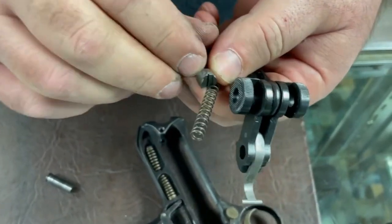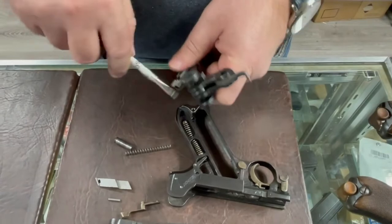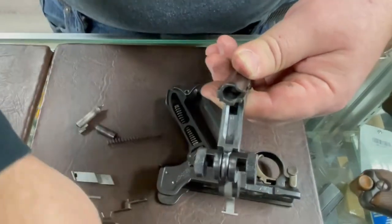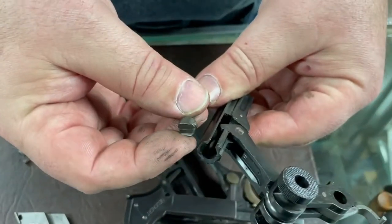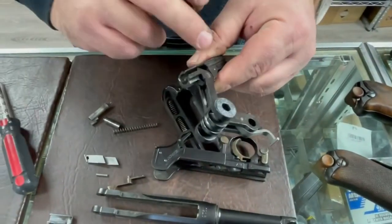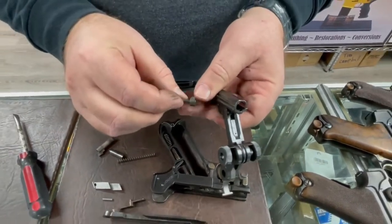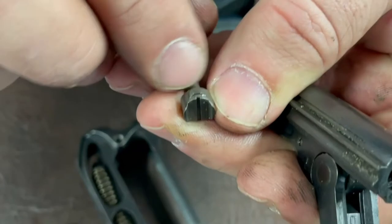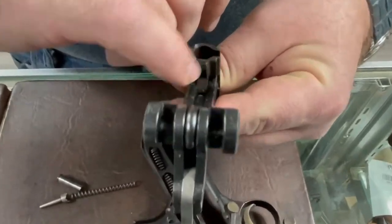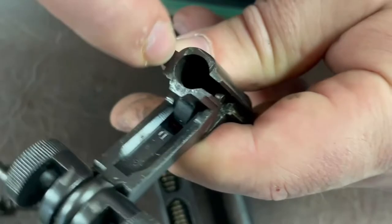The other time you need a screwdriver is to remove the firing pin from the bridge block. Engage the screwdriver, push it in a little bit, and turn counterclockwise — it will jump out with a little spring tension. This part has a protrusion that holds the assembly in place. The bridge block has a corresponding cutout; when inserting, turn clockwise 90 degrees and it will snap back up with the tension of the spring to hold the firing pin, retainer, and spring inside the bridge block.